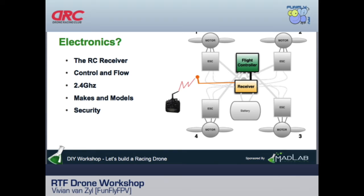Your radio transmits to the receiver, which plugs into the main flight controller. When you push forward on the radio, that instruction travels to the receiver, the receiver tells the flight controller, and the flight controller tells the two rear ESCs to spin up their motors. That's how the whole signal chain fits together from radio to receiver to flight controller to ESC to motor.